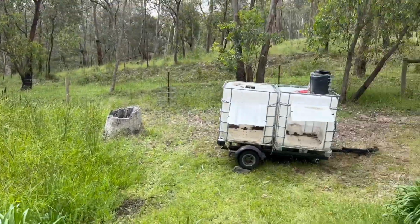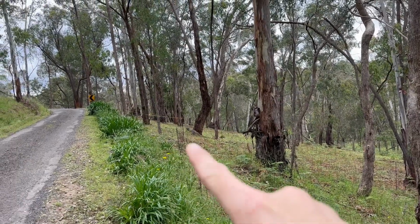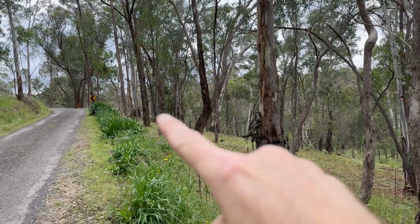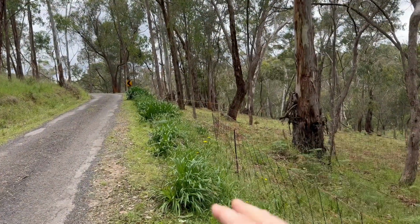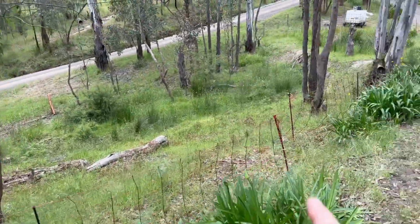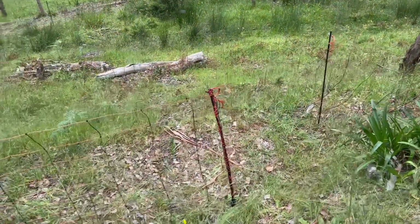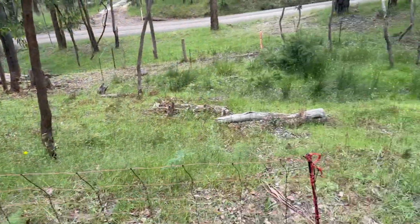So now I'll start putting up the fence. And we're all set up. So that worked really well. So that post there, the old corner one, instead of being internal, all I had to do was invert it back out the opposite way and then flip that original bit of fence down this way, and it came down perfect, meeting up. All I had to do was wrap maybe a foot around that pole, which is fine. I don't mind doing that. But if you're trying to wrap that much, you might as well stagger some posts to take up the tension instead.